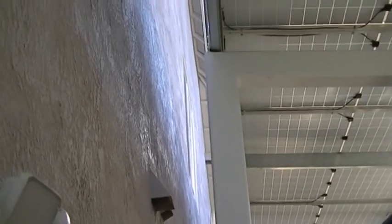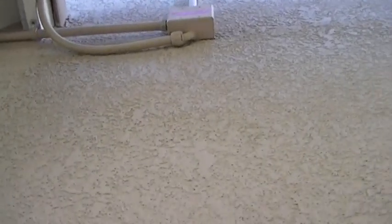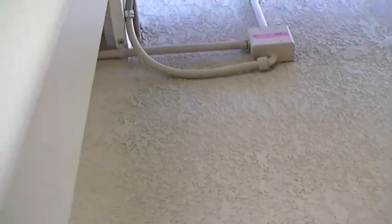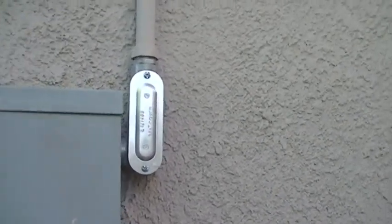For the electrical, we have two arrays on the roof — on the back of the house and on the side. You can see the junction box up there, and the EMT conduit comes straight down. The other two arrays use a solar deck which takes the electrical line into the attic; we run Romex down the attic. That J-box up there is where the two Romex lines come together, and then we use straight number 10 wire down to here and into the box.